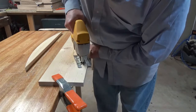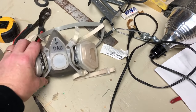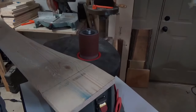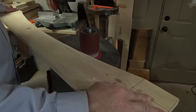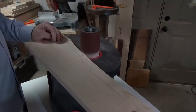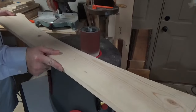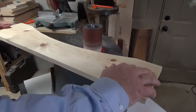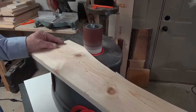This video is actually sped up and it'll give you some idea of how slow I went to try to get a good edge. Now we're going to get into some sanding — it's time for the dust mask. While I've got the vacuum port connected, most of the dust actually gets pulled down into this oscillating spindle sander. I did a little review and assembly video on this around Christmas time. I really like how this thing works on inside curves like you're seeing here on these valances.